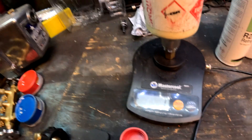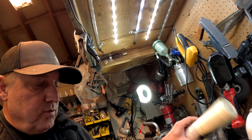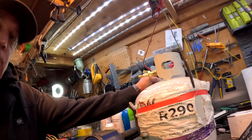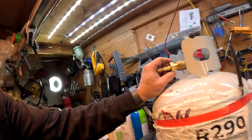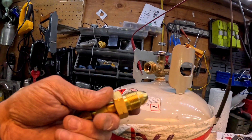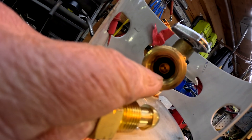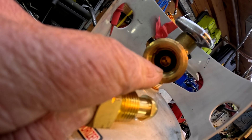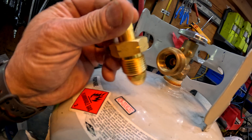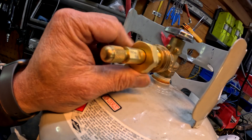These bottles are really annoying — there's so many of them. What you can do is buy the propane in these larger bottles. You get these fittings right here and they go right onto the bottle. But don't drive around with this plug plugged in, because once you push this little piece back in the bottle it can let loose the refrigerant or propane inside. So when you get this adapter, don't ride around with it in the bottle — only put it on at the job site.